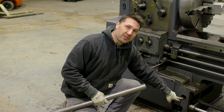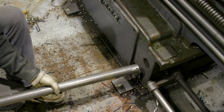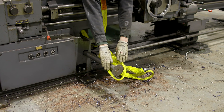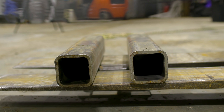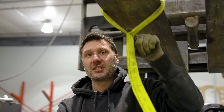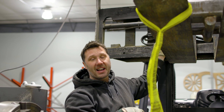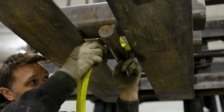The manufacturer recommends we pick it up from this rigging point right here on the bottom of the base, and I'm going to be doing it with this big bar — this is a piece of two inch cold roll and it slides through here. The challenge with lifting this thing is that we have 70% of the weight on one side of the machine. I'm going to be lifting that part with chokers attached to a spreader bar across the forks, on a pin I made the last time I lifted this machine. You don't want to hook the choker directly over the fork because the wide forks spread the choker apart, putting load on the mast and pulling the forks apart — they aren't designed for that. We want everything coming to a central location so no lateral forces go on the forks, only downforce.